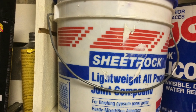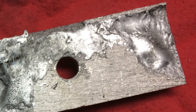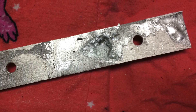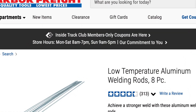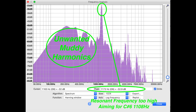Wall spackle. I poured in some melted aluminum and got my first crude bar, but it was a bit undersized and had many sunken imperfections — it had shrunk to a bit smaller than my pattern. I filled the imperfections with aluminum solder from Harbor Freight. It looked pretty good. I was able to trim it close to the right tone, but the frequency spectrum plot was so messy with a lot of lower harmonics, which I attributed to the alloy solder patches creating various harmonics.